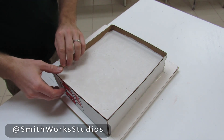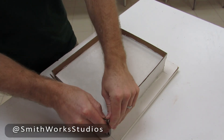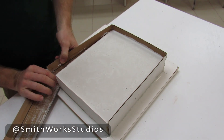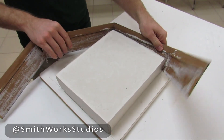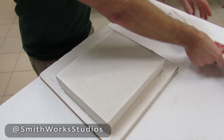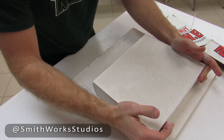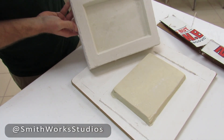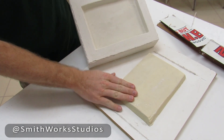It has been about two hours. The mold has warmed up and cooled back down again, and now you can begin to strip your mold. You'll notice where the oil soap protected the cardboard — the plaster comes off very easily. Just strip your mold away, clean up some residual hot glue. After stripping the flask from your mold, you're ready to pop it loose from your pattern. And there is a simple one-part plaster mold of an oil clay pattern using a cardboard flask.